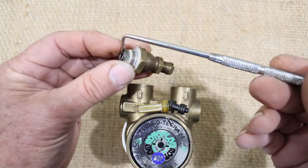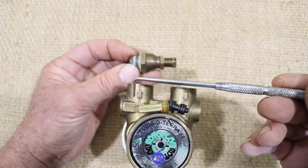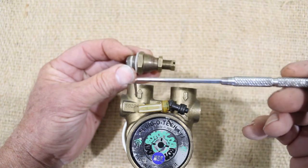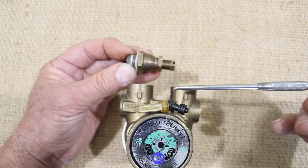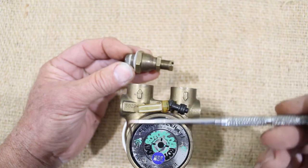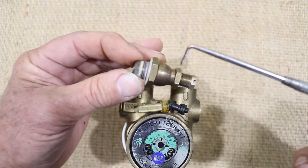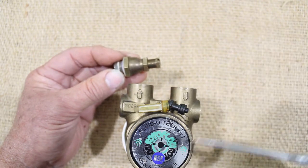Whatever pressure is applied via the spring to the plunger, as the pressure increases in the water, it meets the pressure that's applied by the screw to the spring to the plunger, the water pressure will increase and overcome that and find its way back through and recirculate around the pump, and it starts to recirculate. So if we apply 9 bar of pressure using the spring to the plunger, it will take 9 bar of pressure in the water circuit to overcome that.